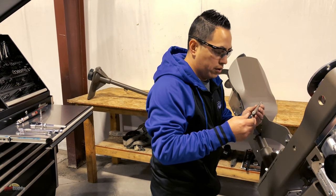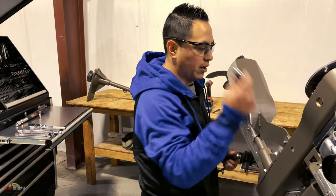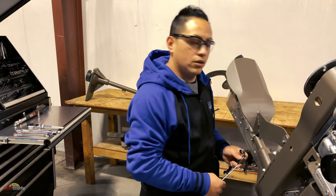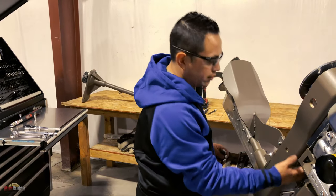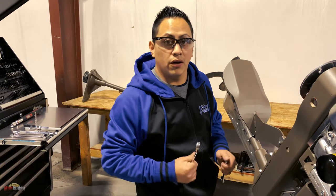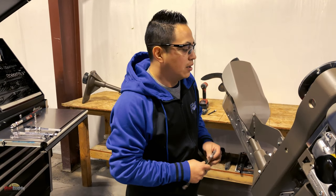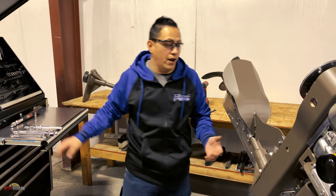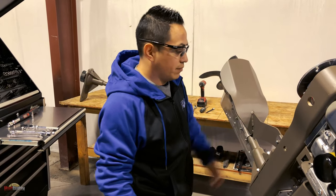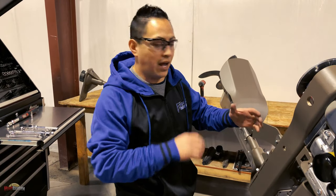This is a brand new motor so I have it at 20 pounds. After that, make sure you tighten everything up — check your bolts back here and up front. Check the description for torque specs and Loctite that you're going to be using. Then go through all your bolts again to make sure you have them all tight.